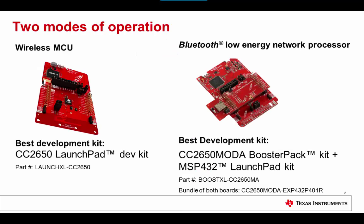The CC2650 MOD-A offers two ways of operation. First, as a single-chip wireless MCU with both BLE stack code and customer application running on the CC2650 MOD-A. The best development platform for this purpose is the CC2650 Launchpad, which is a full MCU development kit. The CC2650 MOD-A can then be seen as another package option in addition to the QFN packages already available, and is software compatible with that specific package option.